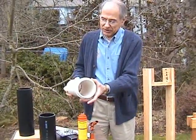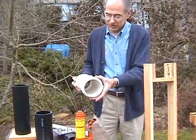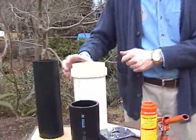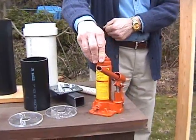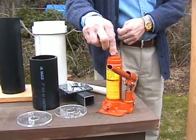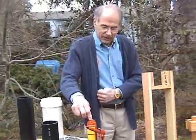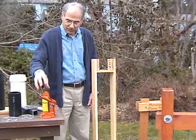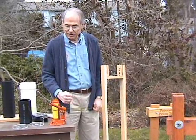This is a piece of PVC from the bell end of a long piece of PVC, which has just been shoved over and glued on, and this gives you the extra leverage you need for ejecting the briquettes. This is what's called a two-ton bottle jack, a hydraulic bottle jack, also sometimes called an axle jack. The two-ton is the smallest that we could find; if you were able to get a one-ton, that would give you sufficient pressure. They come in many varieties, and the key is to get one and then build your press frame based on the height of the jack that you have.